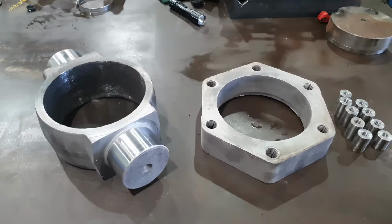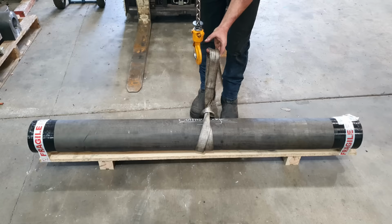So today's job is part two of making the new barrel for the D10 blade lift cylinder. If you missed part one, there'll be a link in the description below where we disassembled the barrel, reclaimed the trunnion mount, and made some new standoffs. So before I can weld these parts onto the new barrel, I need to get it set up in the lathe and turn down the OD.